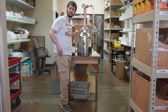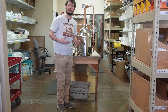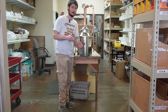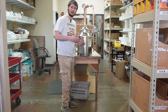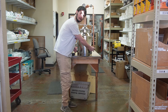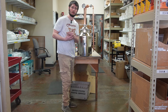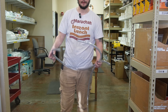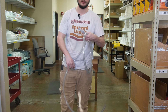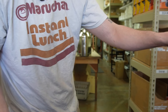So why not start with the easiest of the hose setups? That's pot still mode. Even though this is a specific tower on top of here, this is going to be pretty universal. Any pot still you get from here, or any dual purpose still you're trying to run in pot still mode, it's all going to be the same configuration. We'll get a closeup of this unit so you can kind of see where my hoses are going, but the rule is pretty simple. Water is going to come in from the bottom of a condenser and out the top — that's the same for any still. For pot still mode, all you're going to need are two hoses. These are included when you buy a tower and boiler combo from us. You also get hose clamps, and that's really all you need.